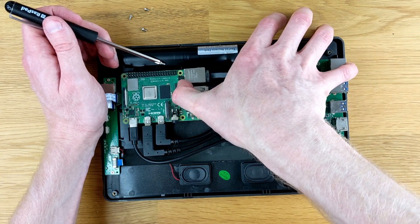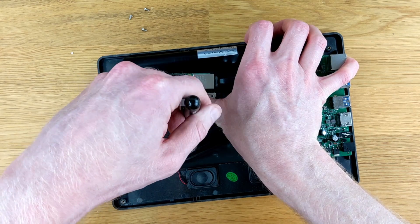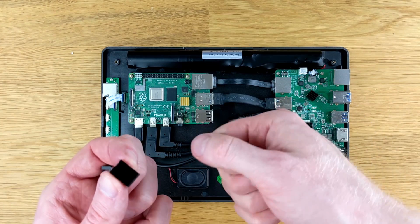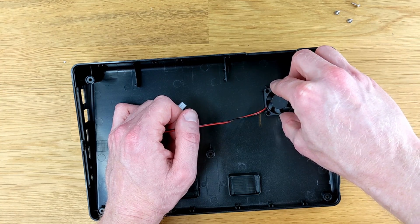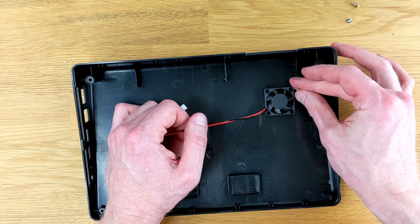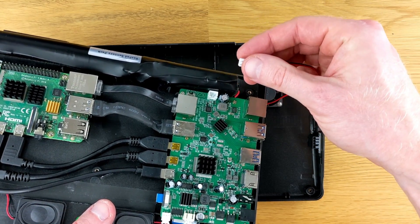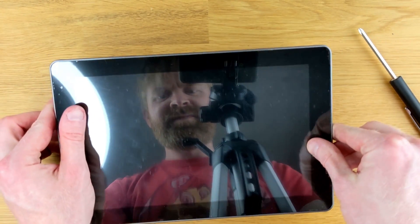Screwing the Raspberry Pi into the Raspad was a little bit awkward because the cables were pushing it all over the place. The easiest way is to put one screw in first and then align the Raspberry Pi. Peel and stick the heatsinks to the Raspberry Pi. On the base of the Raspad, connect the fan — you'll want the sticker pointing toward the bottom to direct air outside. Be careful when tightening those screws; it's really easy to strip the plastic. Then connect the fan to the PCB, double-check all cables, and close up the Raspad.